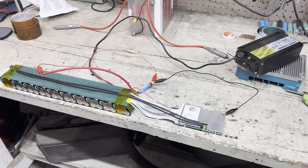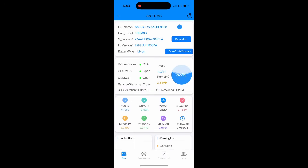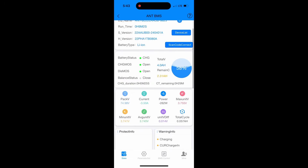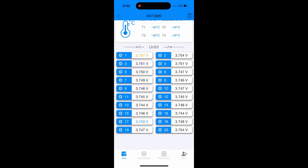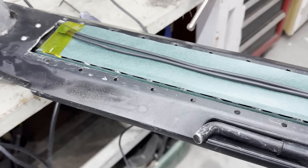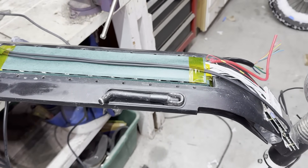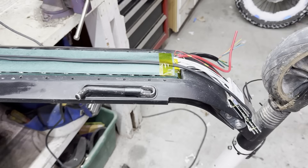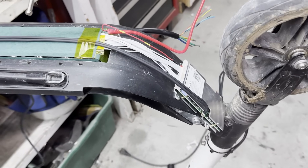After connecting the balance wires, I plugged it in to charge to make sure everything was working right. I also connected to the app to try it out, and I can tell right away I'm going to be using more of these BMSs in the future, because this app is awesome. I can see all the currents, all the voltages, all the temperatures. I can disable and enable the charge and discharge MOSFETs, and there's a bunch of settings to change to make the battery work perfectly. I added some fish paper on the side so I could put the battery in the frame without it shorting out to check the fitment. It looks like it's all going to fit good, so I'm going to wrap the battery part up with tape and then shrink wrap the entire thing all the way up to the BMS.